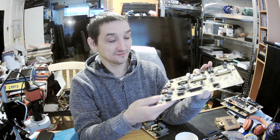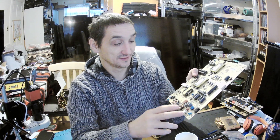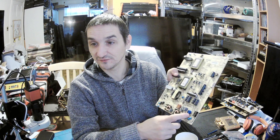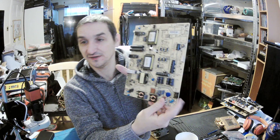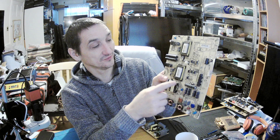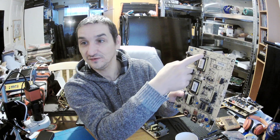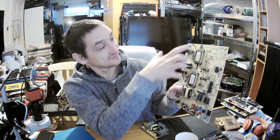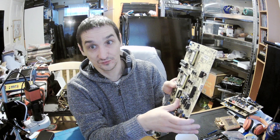And look — that's the mains as well. You see, mains coming in, you've got fuse and neutral, filtration, and you've got varistor here as well. So that's the main board connector — look here, and look how the line is going like this. This is our live side here, and this is our non-live side — that's the part for the lower voltage.